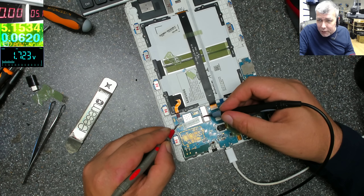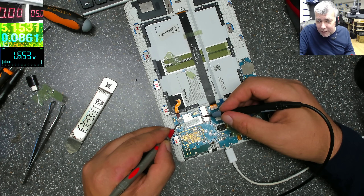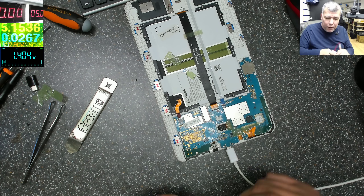Of course, with this kind of voltage it will not charge. The voltage is moving up and down — it's like there is no battery, or the battery is not present. You can't have this moving voltage on the battery because the battery resistance is low. So either we have a faulty battery or a very used one.